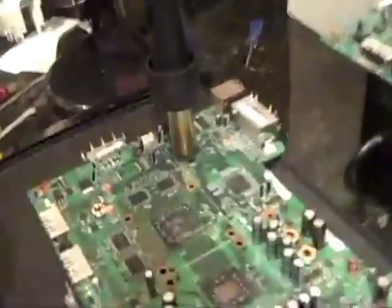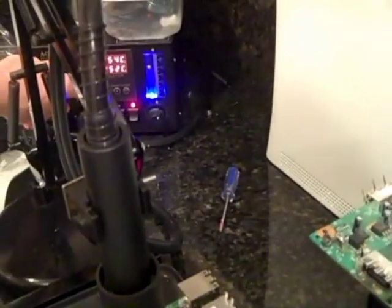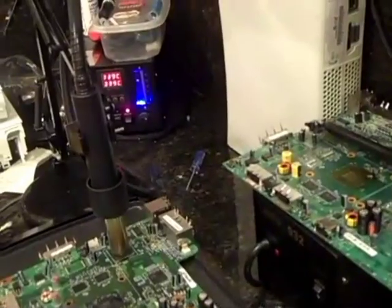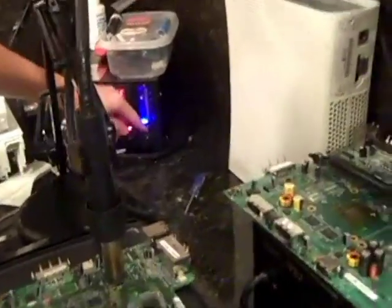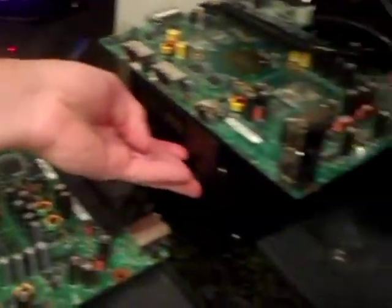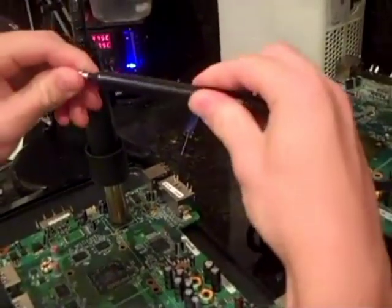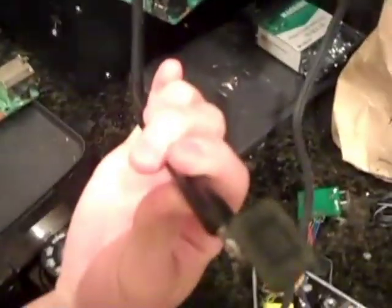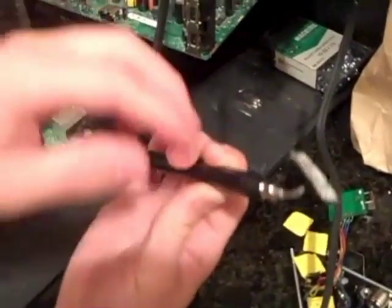At this temperature we're now going to go to 5 and a half airflow, and go up to 300 degrees. Then I'm going one more up to 375 degrees and turning the airflow up to 6. I'm turning on the AU 932 suction pen, putting my tip on it, putting my finger over the hole, and I'm going to lift the chip. All those solder points are melted, so I'm going to lift it off, put it on the AU, and let the chip hold for a second.